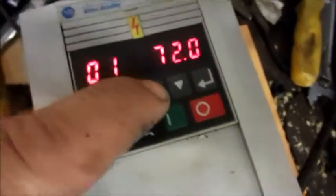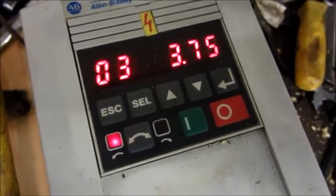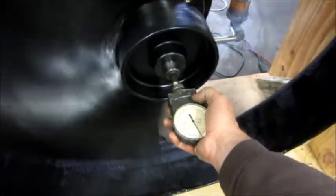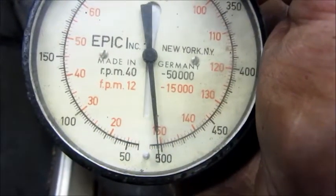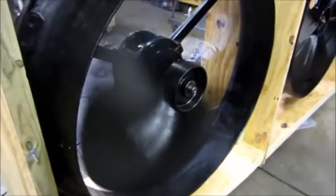Alright, I'm up to 72 hertz, 217 volts, and that's 3.7 amps on the motor, so it's not overloaded but it's right at the limit. I've got the tach here — that looks like maybe 500 to 502 RPM. That's a pretty good overdrive on it.